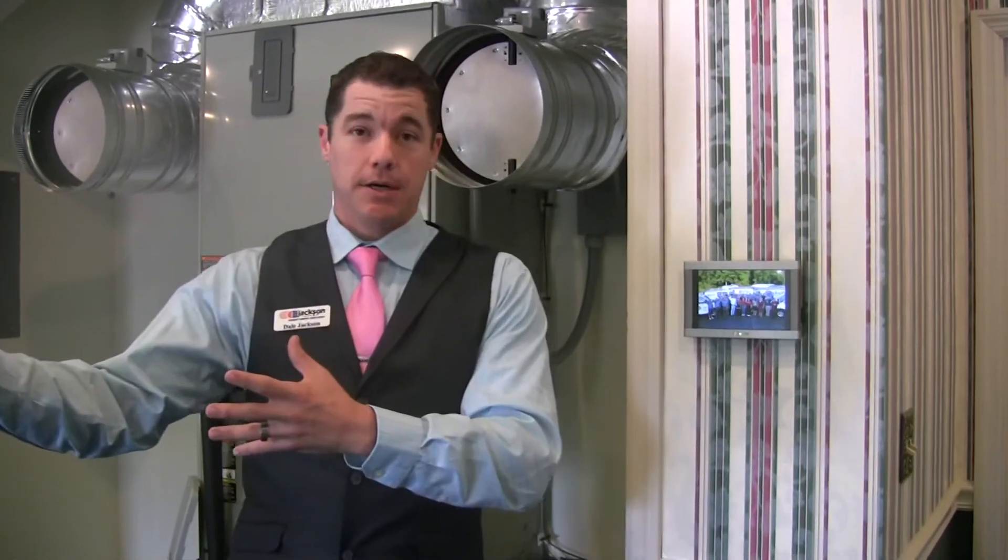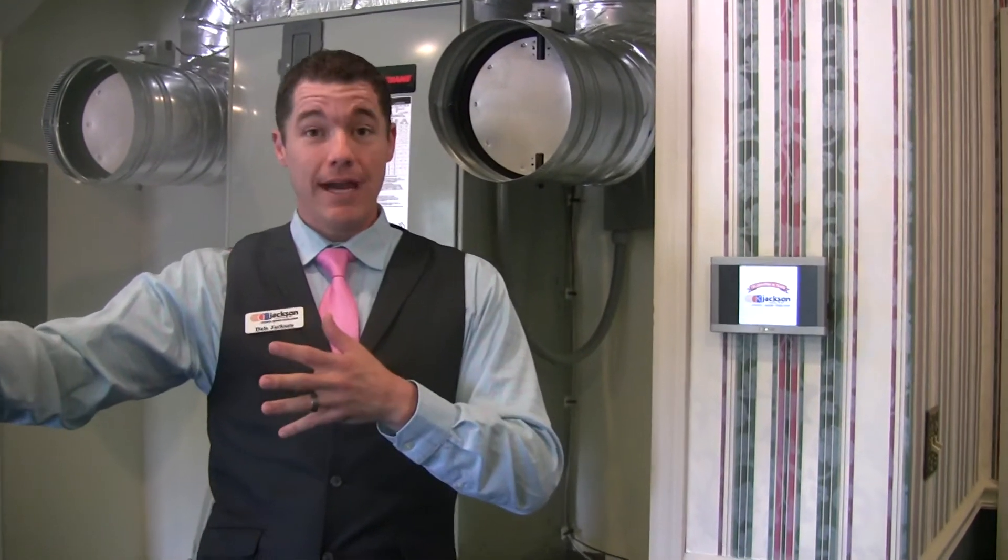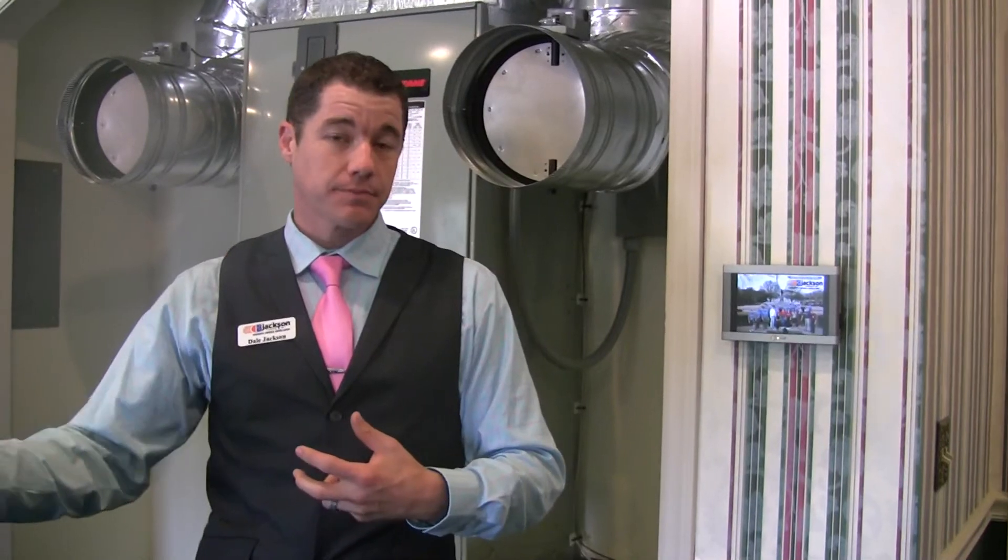So before this thermostat turns off, your zoning controls will scan the rest of your home and say, 'I have this thermostat that is about to come on — I'm going to re-divert my air there so that it never actually has to turn on again.' Because all of the wear and tear on your air conditioning system happens when the unit shuts off and comes back on repeatedly. Not only does that cost a lot of electricity, but that's where all the wear and tear happens. With the zoning system, if we can prevent a lot of those on-and-offs, we can increase the efficiency and the longevity of your system.